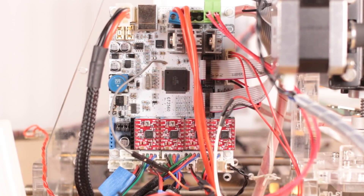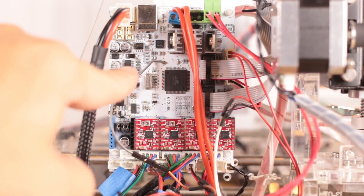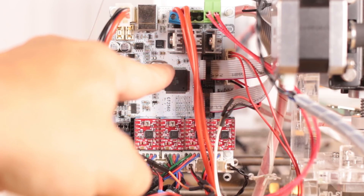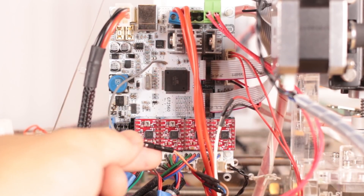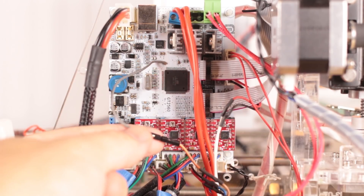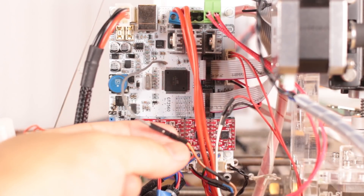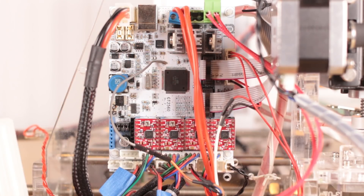It's just a really, really well designed board. The reason I'm primarily showing this shot is so you can see this 5V point right there that I've soldered this gray wire onto — that is where you get your 5 volt power to feed to your proximity sensor. I've used one of these jumper wires that you can get on eBay for Arduino projects, so I can unplug it right here. You have three lines that come in from your sensor: that's the power line, and then the other two lines just go into the regular Z limit switch connector. Pretty easy and self-explanatory.